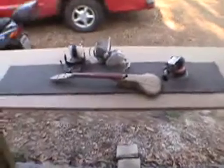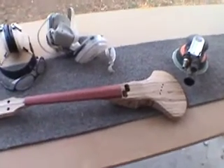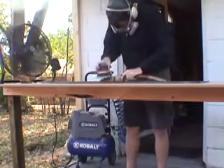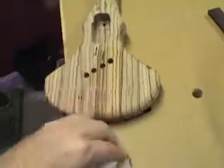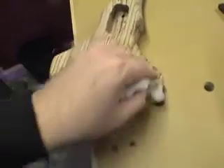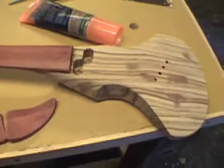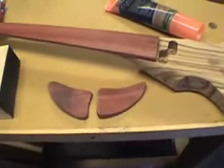It's finally time to begin this really long sanding and finishing process. I'll start by using the orbital and hitting the whole body with 80 grit. The next step is to raise the grain with a little bit of water and then go back and start filling all these little potholes in the wood itself. While that was drying I went ahead and final-sanded these two little pieces for my rest.